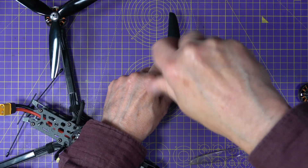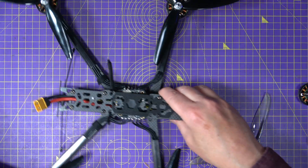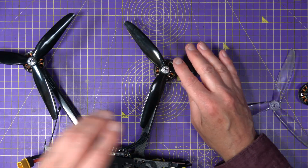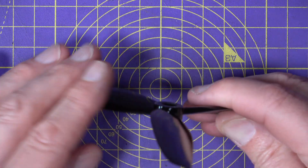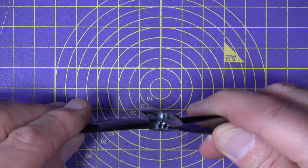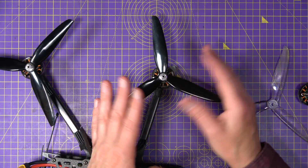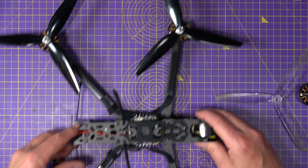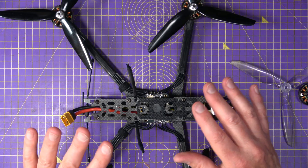So what's the fix for this build? The motors and ESCs are all wired in and changing them now would be a real pain, but fortunately this build can be easily fixed by using different props and a different battery. I've taken these DAL aggressively pitched tri-blades and swapped them out for HQ Props 7x3.5x3 V1S props — still tri-blades but much lower pitch. The result: current draw is reduced, voltage doesn't nosedive, the battery comes down warm not hot, and flight time increases too.